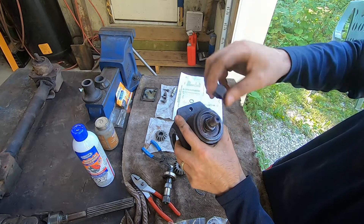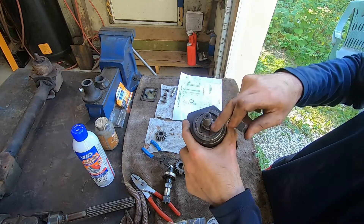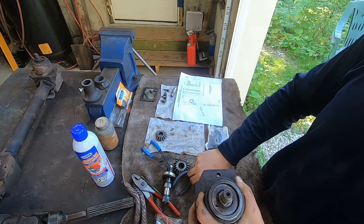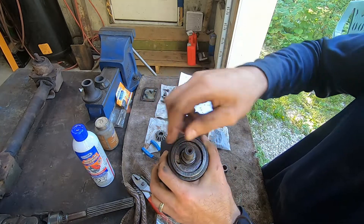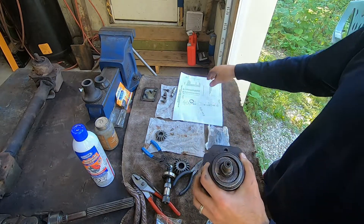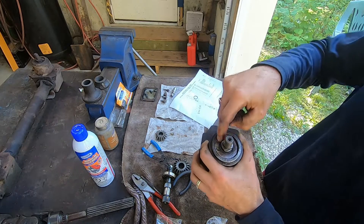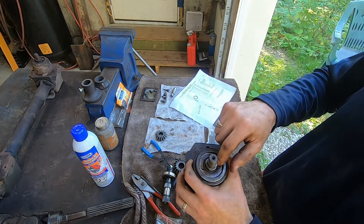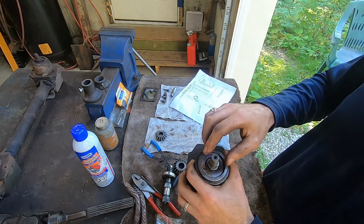Take this nut off — this is the nut that went on the end of the lawnmower shaft. You can't just get the seal out; you have to take this very large snap ring out first. The snap ring comes out, then there's a washer that the diagram shows covering the seal to protect it — in our case the washer wasn't there.